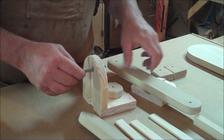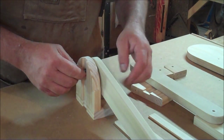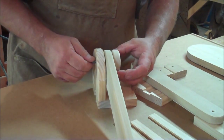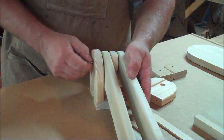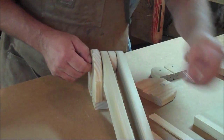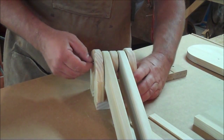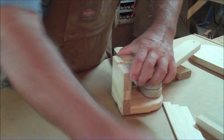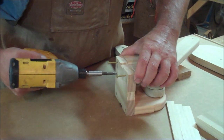I'm going to put a spacer in, a washer, then put my one leg in, another washer, my circular spacer, feed the rod through a little bit more, another washer, and the final leg in, yet another washer. Then I'll take my second wall and fit it in — run the thread through it so it holds. I can now assemble this wall to the base. If you were to assemble both walls at once, you wouldn't be able to get all of your washers in because it would be just too tight.